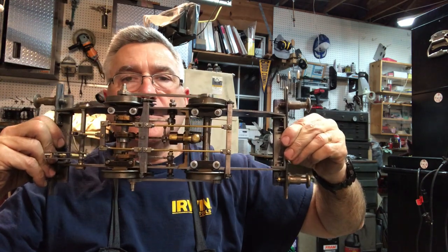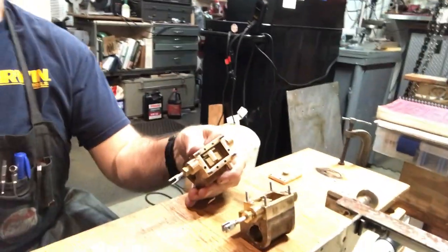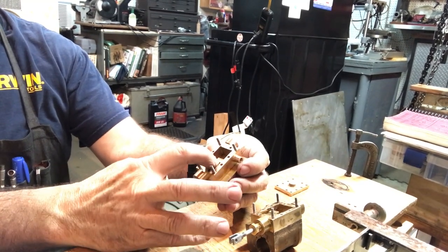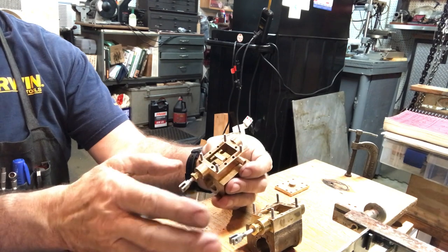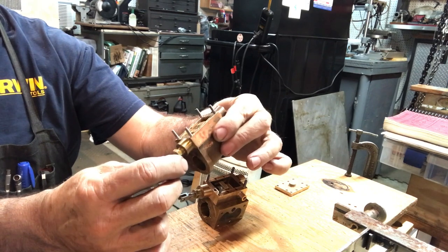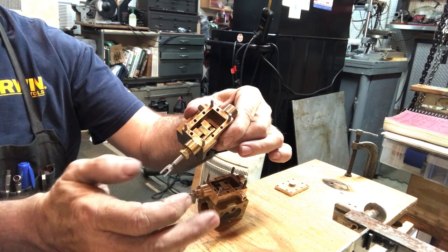This is a three and a half inch gauge — that means the distance between the rails that the locomotive will roll on. This week's episode, we finished up on the steam chests, and we made the nuts for the valves and the valve spindles and the little clevises that go on the end there. It's a lot of fun machining it. Really happy with how things have come out generally. However, I will say one thing I'm not happy with is the valve spindles themselves, which are part of this episode.